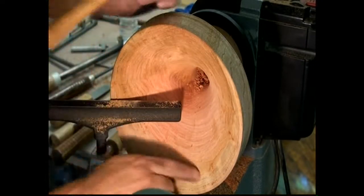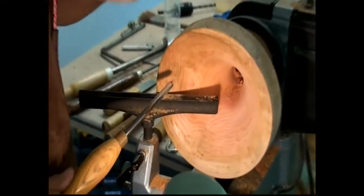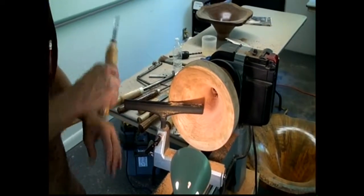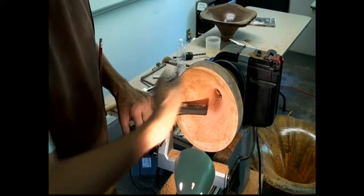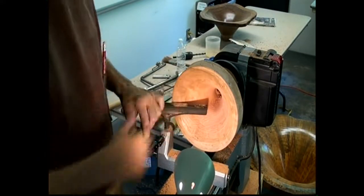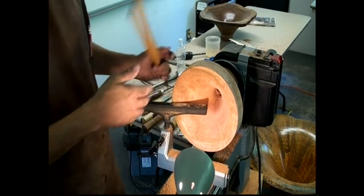See now, that's cleaning this up. There's some deep gouges from the vibrations, and I could come across and do this maybe 6 more passes and get all these vibration scraper marks out of there. The spindle gouge is cutting it pretty good. I might do this cut about another minute, then resharpen the tool again, and do it for about 5 minutes, resharpen the tool again, maybe spray it with water even, because that firms the fibers up, and then just continue to contour my shape down in.